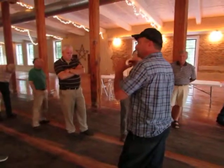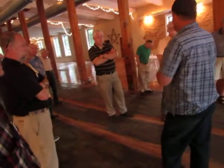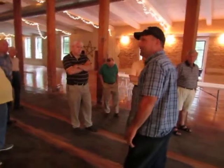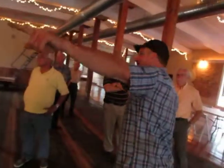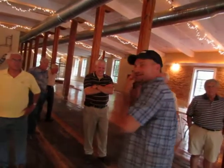So these floors are 5 inches thick. So we had just replaced the oak. We went through with the same groove, 2.5 and then 3/4 inch below, above that. And we got it back fairly level, but what we realized, the building never was built level anyway. And all you got to do is look across the windows on that wing there, and you can see the windows vary 6 to 8 inches each. Now, I think it's a matter of how drunk the brick mason was.